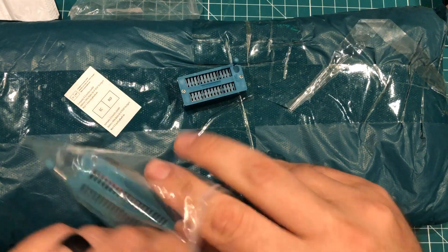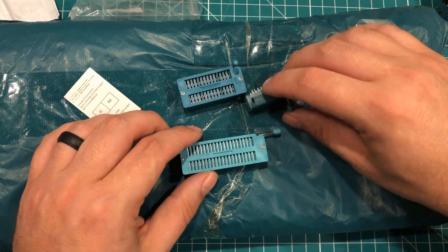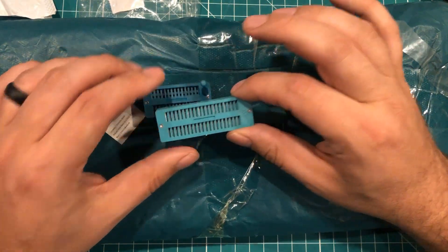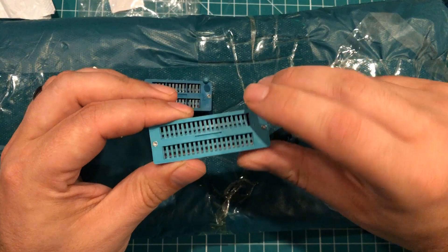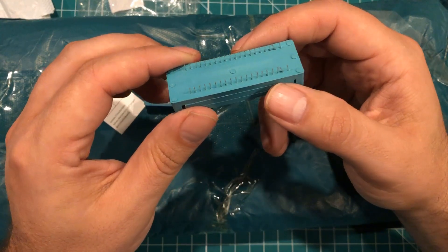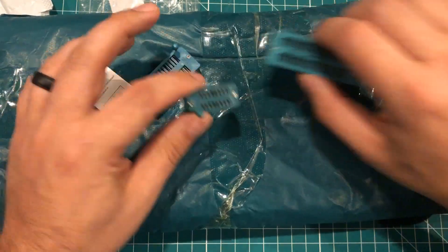The other issue I'm having — and I'm going to do a whole video about this — is they're bundling these things together, which I'm sure saves them on shipping. But one, they're not taking any care when they bundle them together. And two, when there's a problem with one of these things, it holds up all of them, so this stuff came in way later than expected. These are three ZIF sockets in three different sizes. I needed the one with the narrow gap for some of these EEPROMs so I can do single width and double width DIP chips. I highly doubt this is by 3M — the screws are all stripped out and junky. Just bent pins and stuff like that that really aren't necessary. I got them in three sizes: looks like 40, I'd guess 28, and maybe 16 or so pins. This one's obviously just single width. A couple of ZIF sockets — they were a couple bucks apiece.